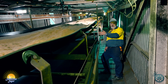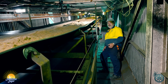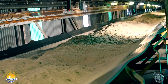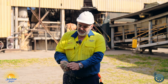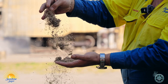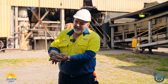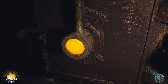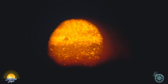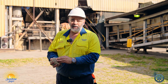This is the bagasse fibre coming from our milling train being fed directly to our boiler to produce the energy that we use here on site. The bagasse is the leftover cellulose fibre once we've extracted all of the juice and the sugar out of it. This fibre is quite dry and fluffy and we use it in our boiler station as fuel. So everything you'll see in this presentation is fuelled by the sugarcane plant itself from the steam generated by our boiler.